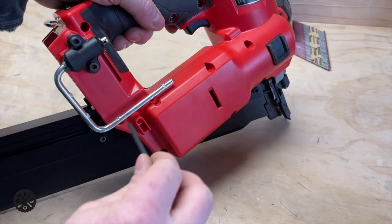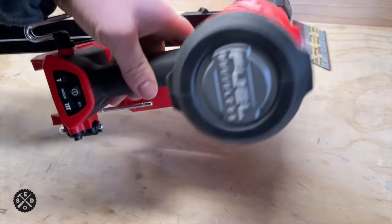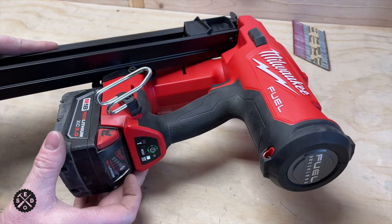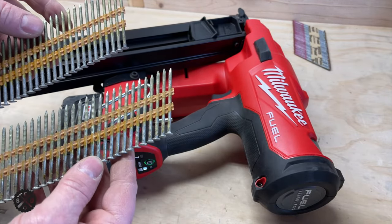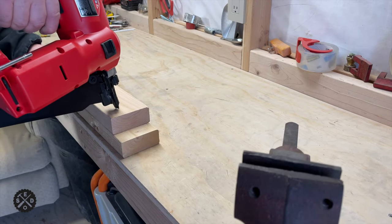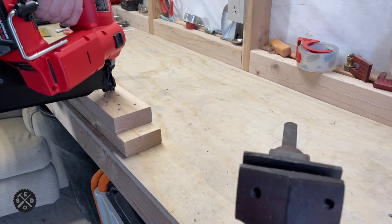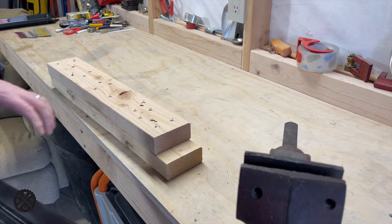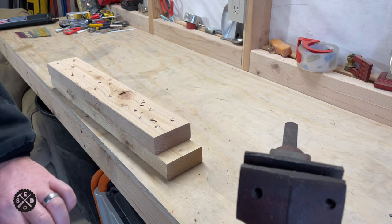So now we're going to test it out. Don't forget to put your Allen wrench back when you're done — always want to keep that in case of jamming. I'm going to put the battery back in, turn it on, and I have some strips of — I think they're two and a half or two and three quarter inch 21 degree nails. It's loaded and ready to go. Seems to work great. I did have two dry fires, two misses, but I think that was just because these nails are a little bit messed up from transporting them — I brought them home in a tool bag.